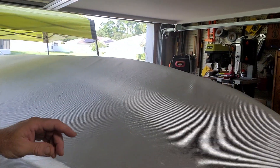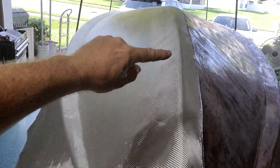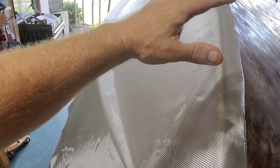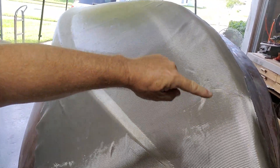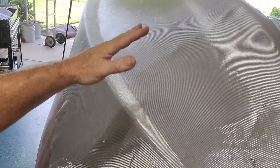What I'm going to do — and the fiberglass is held in place right now just by sitting there — is go over the top and wet that down first, so I'll have a basis. When I start rolling and squeegeing it, it's not going to slide off in any way, shape, or form. I'm going to wet out the seam at the top first, probably about eight inches or so from front to back, and then start from the back and work my way forward to wet it out.